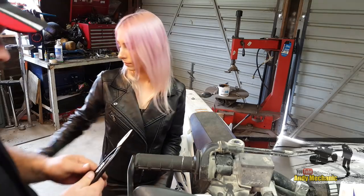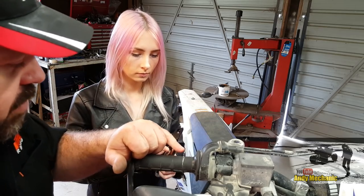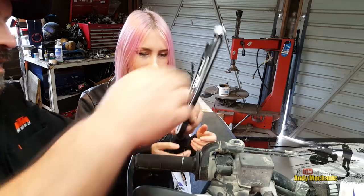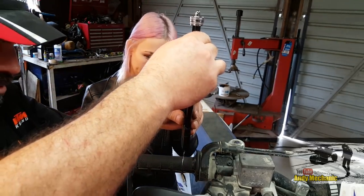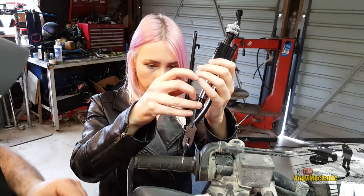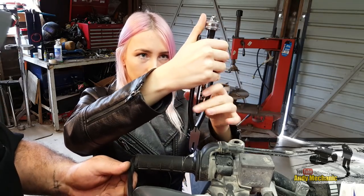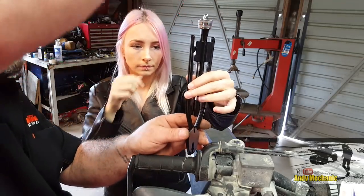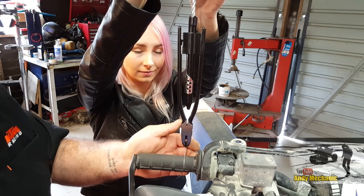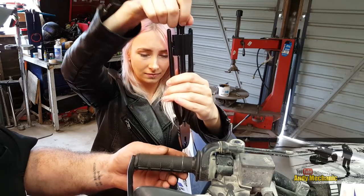We need those magic pliers now. Put the pliers on top and grip the protruding pair of wires about halfway along their length — about two thirds up — so you have the pliers vertical. Lock it off once you're in position. Then you're going to pull that magic bit at the end, and as soon as you start pulling, let go of the pliers and give it a twizzle all the way up. Once you've got to the extent of that, hold the pliers again, release the twist, and it'll spin back in again. Repeat the process until you've got enough twizzles to hold it.